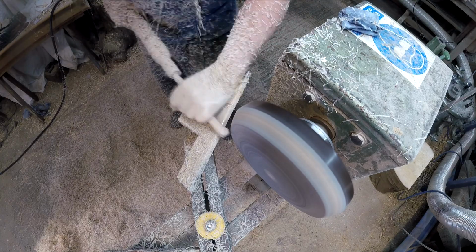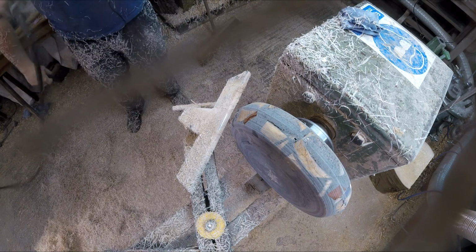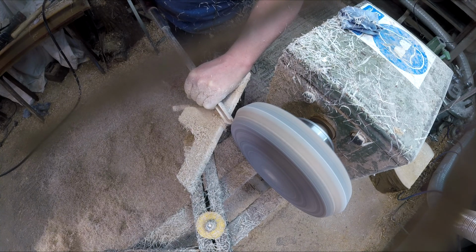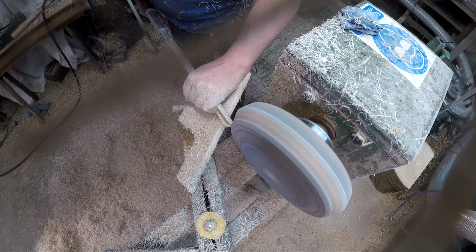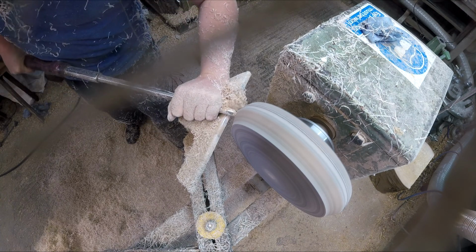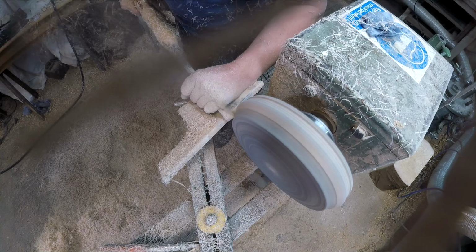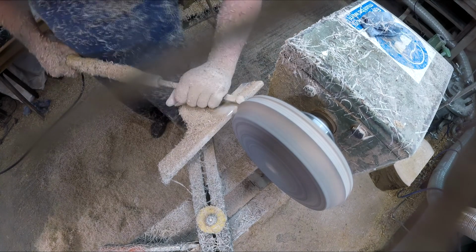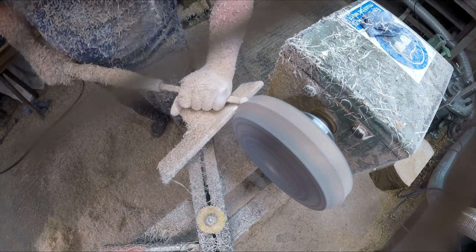So I'm doing one of my floating bowls, which is to say that when you put the bowl on a table, the bit that touches the table you can't actually see, so it appears like it's floating. There were a few voids in the outside, but I filled those with CA glue and sawdust. I just wanted to try the 40/40 grind on the outside and see whether it would give me a better finish. And the answer is no, it didn't. I think because there were so many different directions of grain going on, the chisel was bouncing slightly, and it didn't give me any better finish than using the carbide. Probably a bit worse actually, so I went back over it with the carbide.